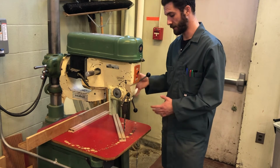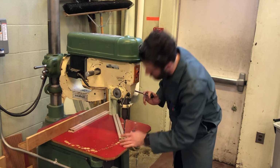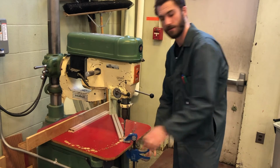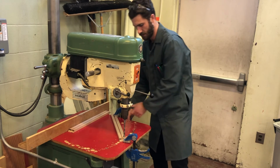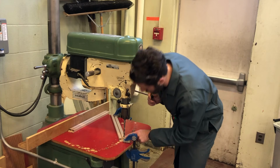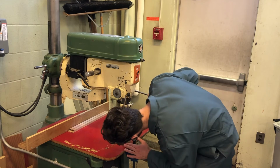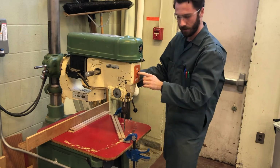Again, the drilling process is going to look like this. We are going to locate the center hole of our center punch mark with the tip of our drill bit. Then we will lock that in position with the spindle lock. Then with the combination of 2 quick clamps, we will secure our piece to the table. And now that that is secured, we will release our spindle lock and double check that we're still in the same spot. And if everything is good, we can drill our hole. That again, we've set our depth stop so that it'll only drill so far. Here we go.